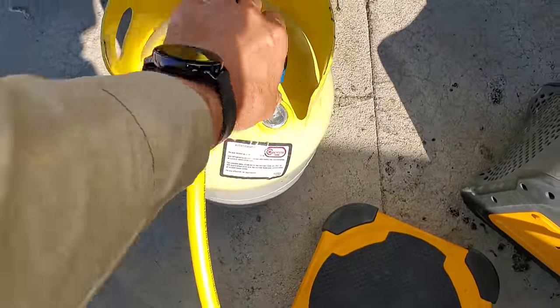Currently testing my decay right now. It's at about 822 microns and it's been running for about 5 minutes in the decay test. So I'm pretty confident we don't have any leaks. I'm going to go ahead and pull down again though, because I think we've got some non-condensables, some moisture, something in there, obviously contaminants of some sort. But it's looking good, so we're going to go ahead and pull down some more.